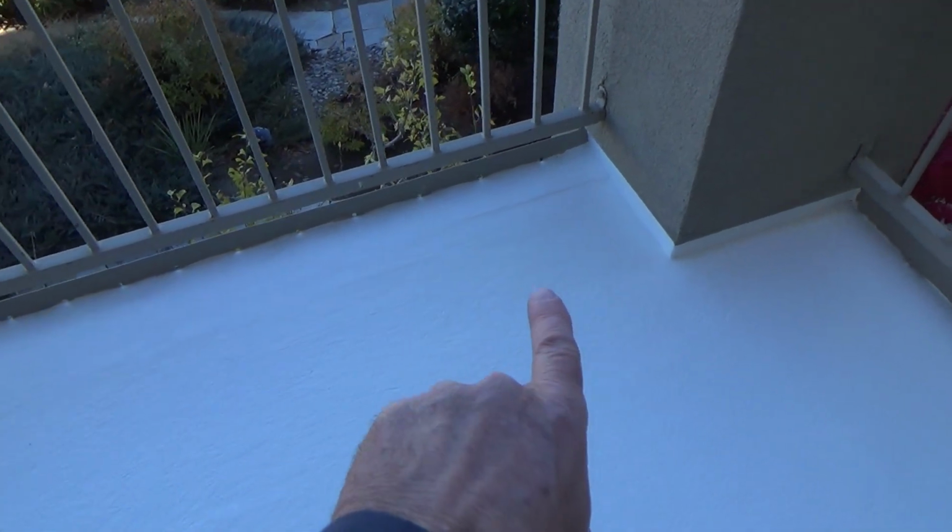So when it rains, water's going to hit here, and it's sloping down, and it's going to go out of these weep holes right along that flashing. And I've got this angled such to where when the water hits here, it's going to go out that way, and then over here it's going to go like that. You know, these sides, even though this flashing, I put holes in it, really not much water is going to set there except anything that is within a couple inches of that, because this floor is floated from here this way. So if anything gets up in here, the water's going to come this way and out. So there's really hardly any water going to go out of that.